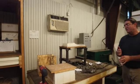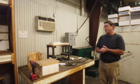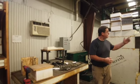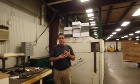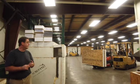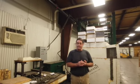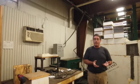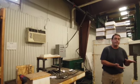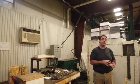This is great. So all of the materials come in, all verified or stamped before we get it, and then we run it through the process of assembly. Running the foam through the glue, adding the moisture, running it through the pressure in the presses, and allowing it to cure. The only thing that we can really test after the fact is that our glue line was good, and that's really the only thing that we can control, making sure that we have the right amount of adhesive going onto the foam, and then making sure that the adhesive is reacting correctly and curing properly.